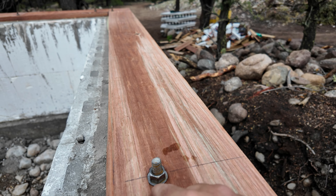With things bolted down, the next step to building the subfloor is going to get our rim boards. If we get those rim boards down we'll probably go ahead and do this back wall first, then put our rim board along the side there and along the back, because our joists are going to be running from that side this way, with this girder in the middle. So that's the plan — go ahead and get those rim boards put on.